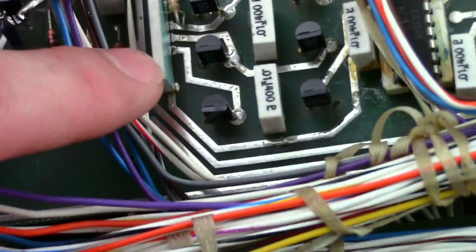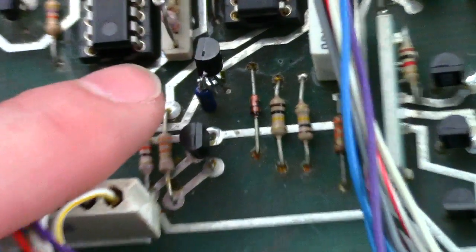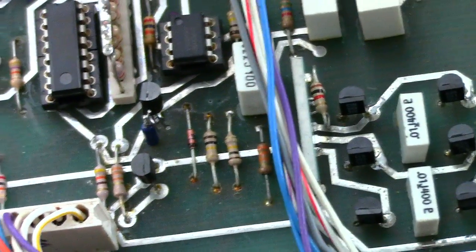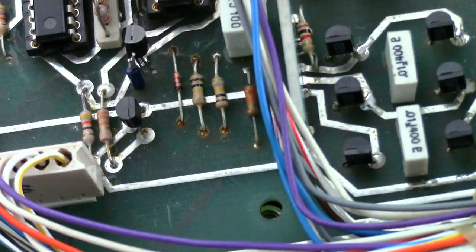For pins 9 and 10, I actually left them together but shorted them — I soldered the two legs together. Then I went over here and changed this resistor that was originally at the leg of this transistor. Originally you had like a 5.6K there, and then that was a 7K, and they were in series. So I installed a 12K resistor, which basically takes the place of both of those resistors. And that's a 2-watt resistor so it can handle a little more current. That took care of that problem.